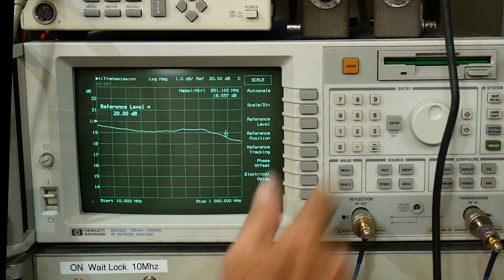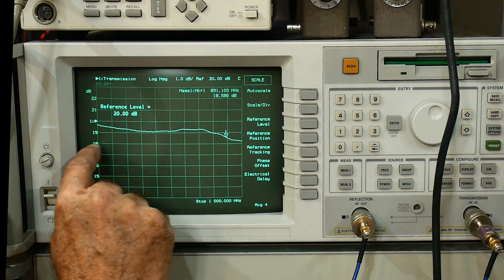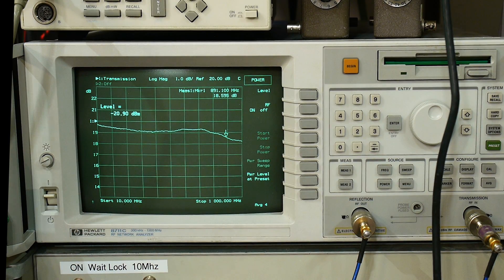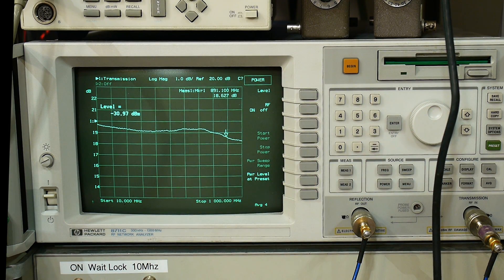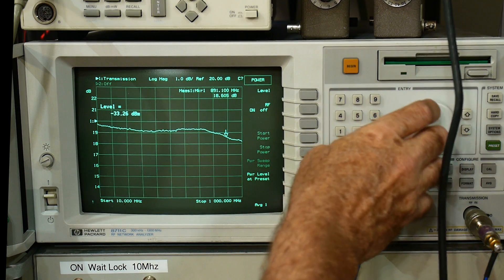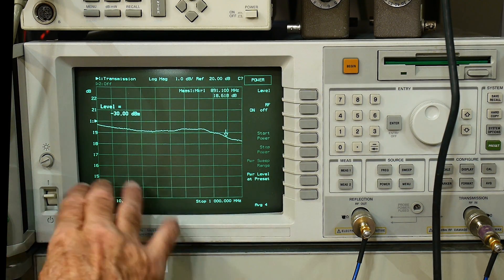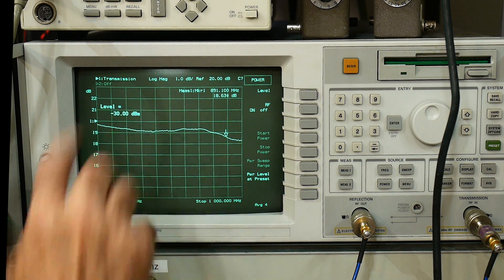We'll set the reference level to 20. This is the 20 line, this is the 19 line, that's the 18 line. Now let's look at the power — we're inputting minus 20.9 dBm. Let's go down to minus 30 dBm input. It doesn't matter what the input is, you will still get 20 dB gain. Here at minus 28, minus 33, minus 40 — it's still always giving you the same number. So we'll start here at minus 30. It's measuring the input and the output, giving you the difference — always measuring about 19 dB of gain.